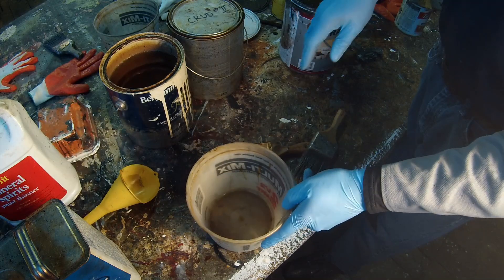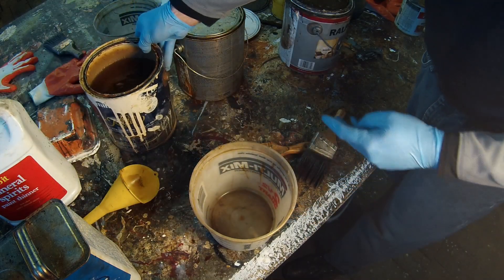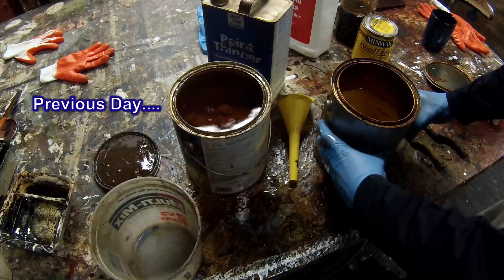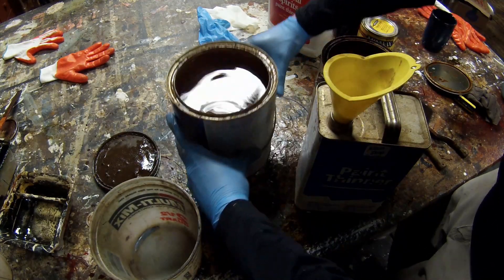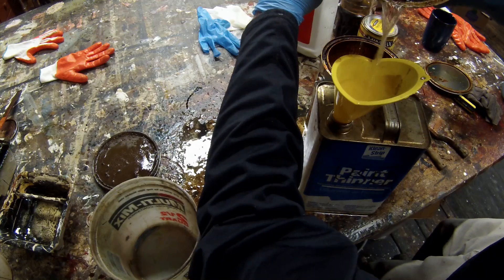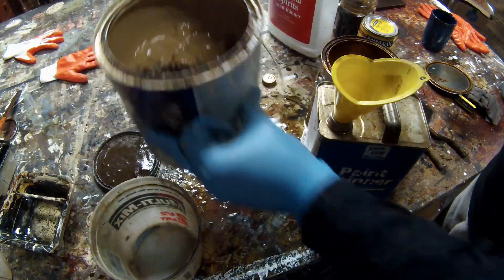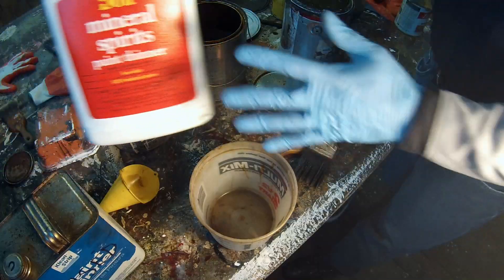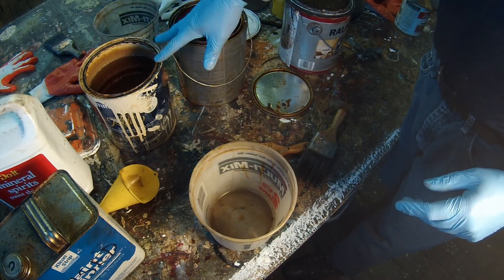These crud containers I use to put my discarded mineral spirits. When I'm done cleaning the brushes in the container, I pour it back in here. You can see that there's a lot of sediment that has settled over time. The idea is that the discarded mineral spirits will separate over time — if you just let it sit for a few months, you'll get all the solid matter settling on the bottom and the top layer will be almost clear liquid. That liquid you can salvage off the top, pour it into another container, and reuse it for your first and second wash cycles. So instead of pouring clean mineral spirits to start the cleaning process, I use the used mineral spirits which came from these containers after it settles.